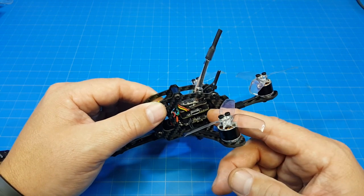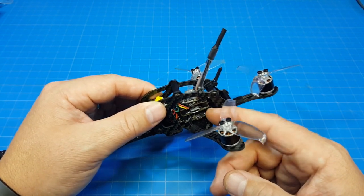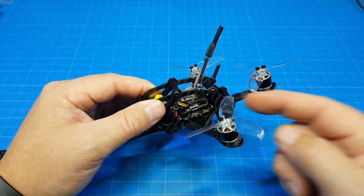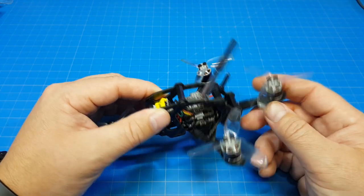You can also get the Speedix IS-100 flight stack. It's very comparable, but it does not do smart audio. So that's a minor difference, and you have to use the button on the side to get your channels and pump up your milliwatts that you're running your VTX at.